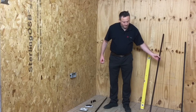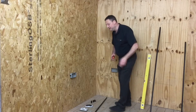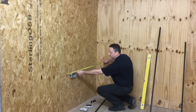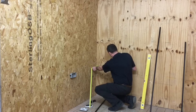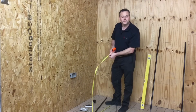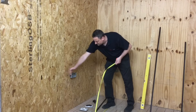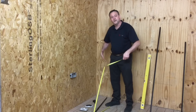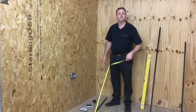First we need to work out the length to cut the conduit at. We're going to cut it longer than we need — I'll overhang the box on both sides and bring it out to about 170 centimeters or 1,700 millimeters. I'll cut it back once I've put the smooth bend in it.